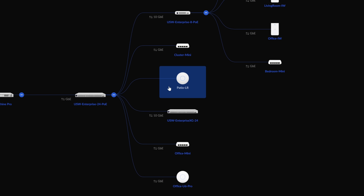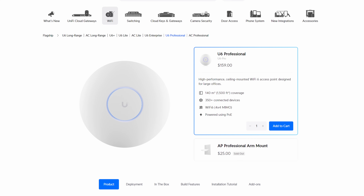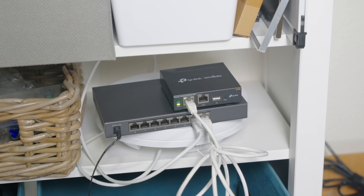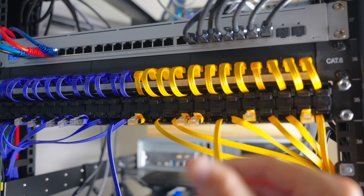The other two access points are Wi-Fi 6. Upstairs I have a U6 Pro which is a 4x4 Wi-Fi 6 device — pretty solid, and I've gotten around 800 megabits per second over Wi-Fi to my MacBook, which is great considering this isn't even Wi-Fi 6E. Then we have an access point outside on the patio which is a U6 Long Range. I don't actually think I need the long-range version but I figured why not. Overall I'm content with this setup. I also have a TP-Link Omada short-stack setup I use for testing Omada releases that acts as a separate test LAN.